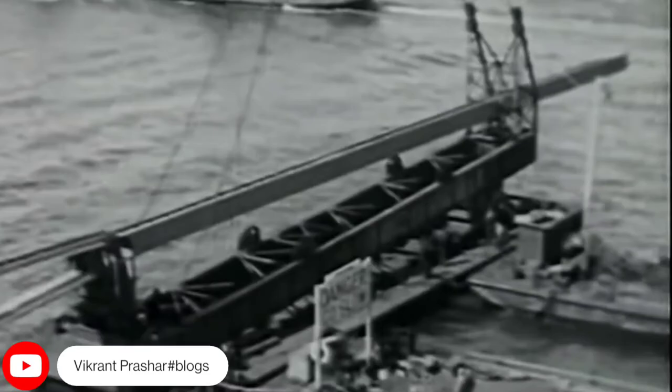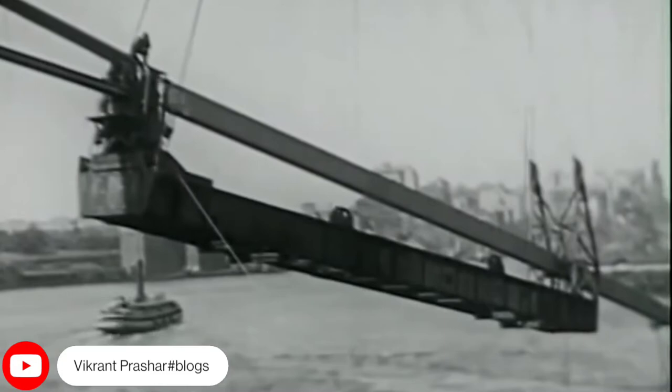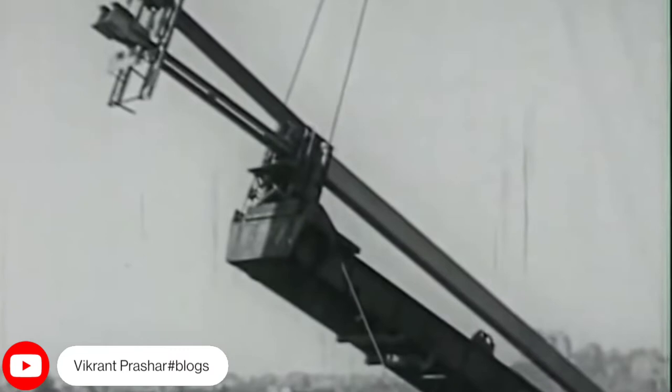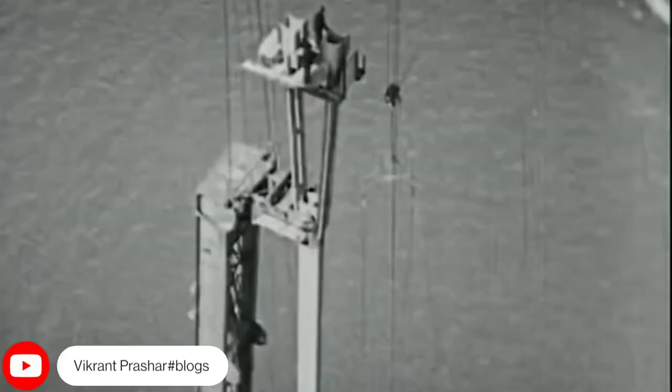The hanger was laid horizontally in a cradle built of two railway stringer girder sets in tandem with horns at each end to house the hanger. The hanger was 198 feet long, or no, 200 feet for that matter, and as it was lifted up, the auxiliary hoist turned it into the vertical position, and you'll notice when it's being lifted, this horn on this cradle allowed the top of the hanger to come up and make contact with the gussets underneath the cord, while the ropes hung down the side of the cord.